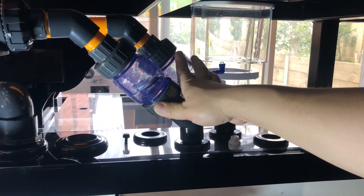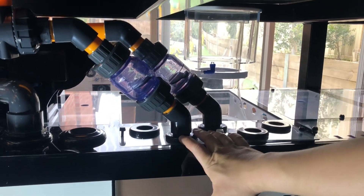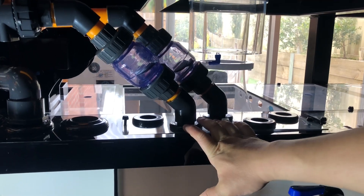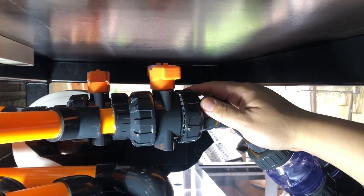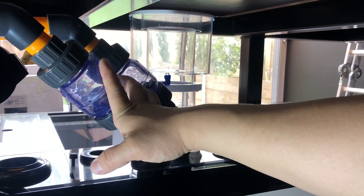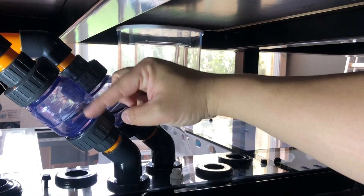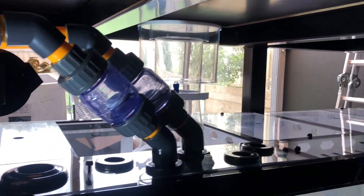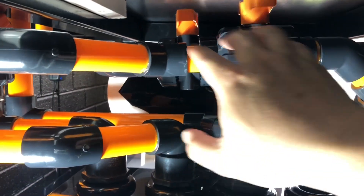As it comes out, you've got one pump for each of the return lines. They both run check valves in line. There's definitely going to be enough space in the sump to take the backflow of water anyway, but I did want to put these in as an extra safety measure. Then it goes to two true union valves — a valve with a union on each side so I can very easily take it off. With the check valve, I do normally have to run these vertically, but I checked with Billy Hwang from New Life Aquarium in Keysborough, who checked with Sand King themselves. They said as long as the flap is situated on the top, it can drop down and still works from a 45-degree angle. One return line runs to this side, and one shoots over to the other side.